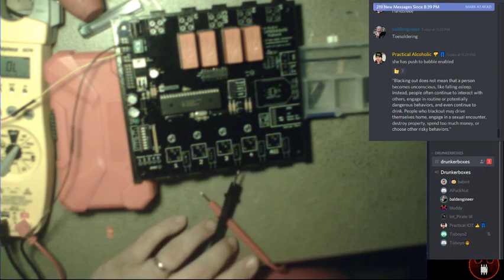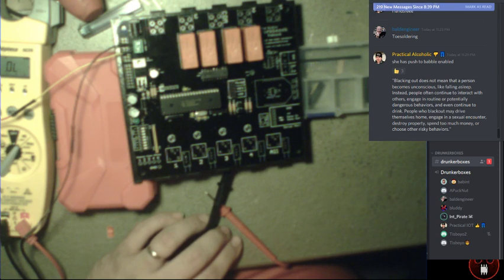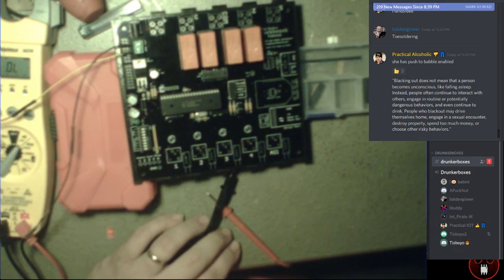All right. I realized earlier you told me this is a 4-port antenna. Whatchamacallit? What does it do? It's a 4-port coax relay. So it's a 4-port antenna switch. For what? Amateur radio. Oh, so you have 4 different antennas going to your radio. Correct. So then, okay, why is there a microcontroller and buttons? Why is all this stuff here? The microcontroller is there to handle the serial communication over the XB. So the buttons actually talk to the micro, and the micro controls the relays? It does, yes. Are you sure I didn't design this? Because it looks over-designed. Yeah, there's a lot of parts on this.